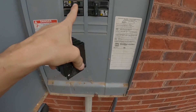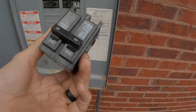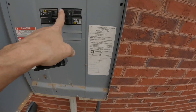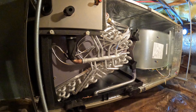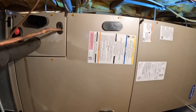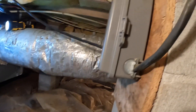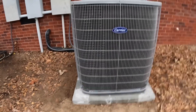I had them change the breaker because this is a Homeline panel and somebody had tried to put one of these Cutler Hammers in there — I guess it's an Eaton — but it's a good idea to replace the breaker anyway. This is the coil; I had to check the orientation and that is correct. This picture is halfway through the job, about the middle of the day, and here we are after five, wrapping things up. Everything turned out just right for these people — they've been waiting actually for over a month now to get something other than emergency heat. I really do appreciate the help that these guys give me; I couldn't do a lot of the work I do without them.